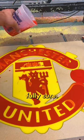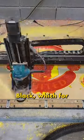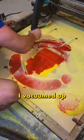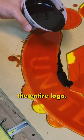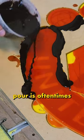We're going to leave this overnight to fully cure. The next day it was time for the final color, black, which for this logo is mostly just the outline. Once it was done, I vacuumed up all the sawdust, mixed up another batch of total boat resin, dyed it black, and slowly went around the entire logo making sure all the tight areas were full of black resin.